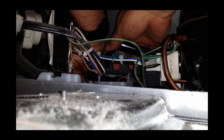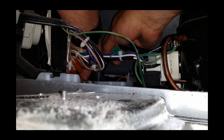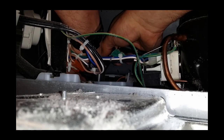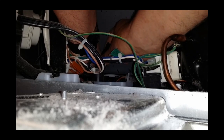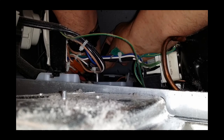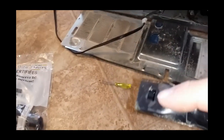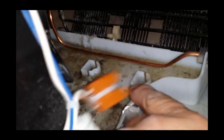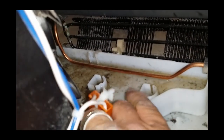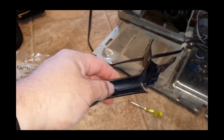Once you get in the hole, you just push in with your screwdriver and pull up on the trough — hopefully without breaking it, that's the key. The trough is now out of the way. Just to show you: that's where I'm pushing with the screwdriver to release the tab on the back side of this little molding. Cutting it in half gets it way out of the way and makes it much easier.